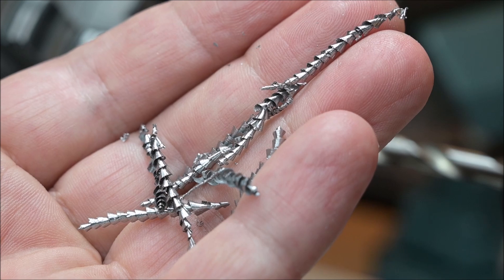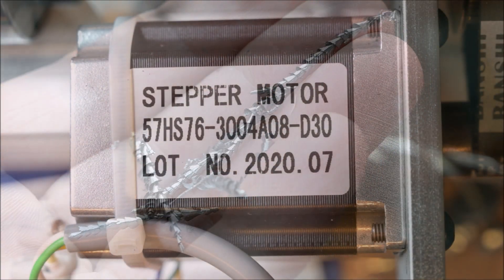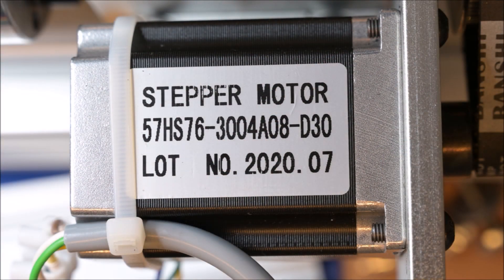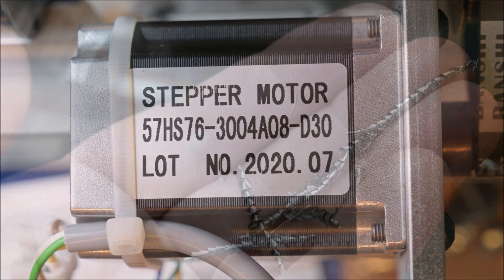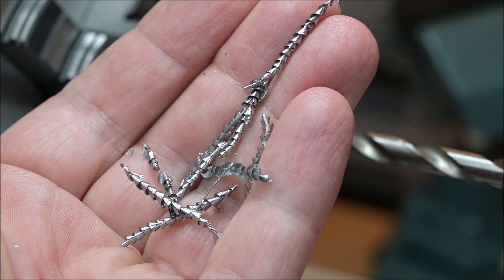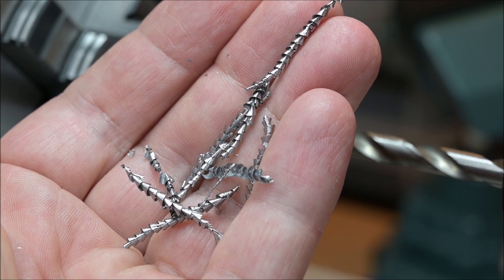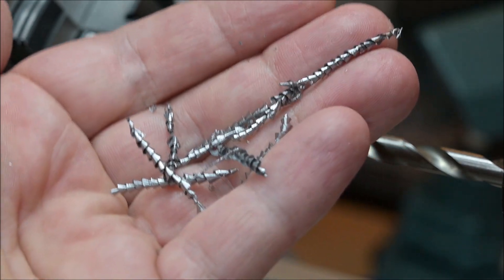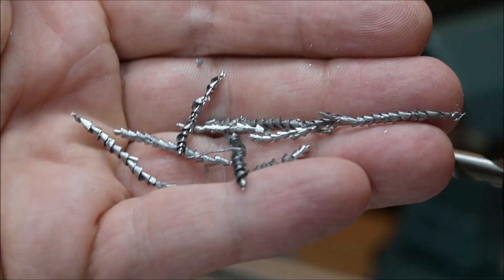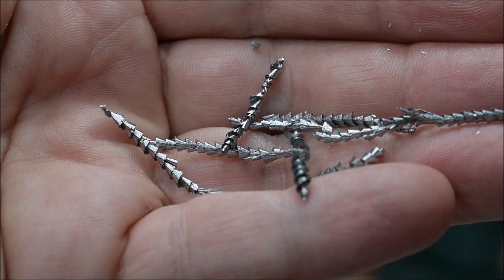As a spindle motor, of course the stepper cannot be very big. My stepper is a 1.8 Newton meter, 3 amps, driven by 48 volts, so it's a good stepper motor considering its size. I'm going to continue with this project. I managed to produce some swarf — not just some dust — so I'm quite happy with this. That's it for now, thank you for watching and I hope you enjoyed it. See you next time.